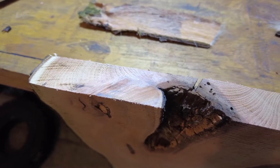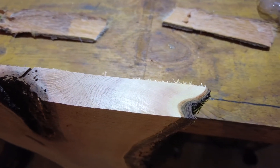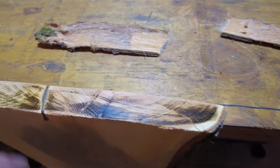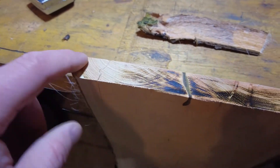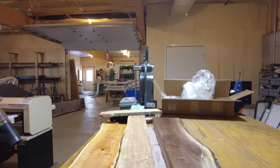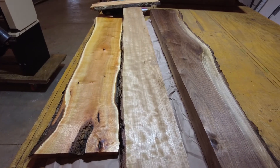I cut off the ends with my miter saw. I noticed this wood burns very quickly so you have to be very quick with the saw. The finish is really nice — you can tell this stuff will probably finish up nicely. It almost looks like bamboo in consistency and grain pattern, at least on the end grain. Now I'm going to try to run this through a planer. I just ran the buckthorn through the jointer and did not sand it at all.